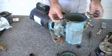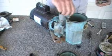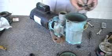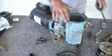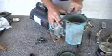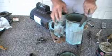We have a number of these where the T-bolts will break because they just got seized up and they got turned too many times and got broken because, why? They never got lubricated. If they are dirty, if you've got scale, you can take a wire brush and clean these things up. These aren't bad at all. But what I like to do is take care of the surface while I'm here. Again, easier when the pump is plumbed in and nothing moves for you.